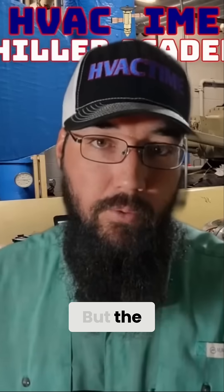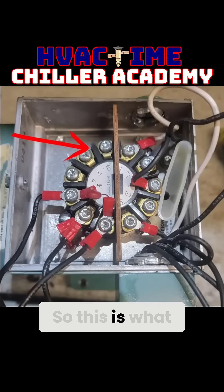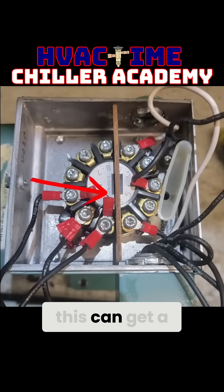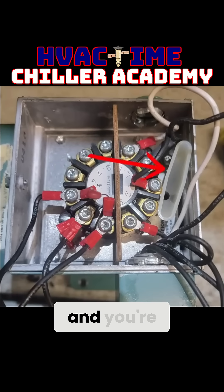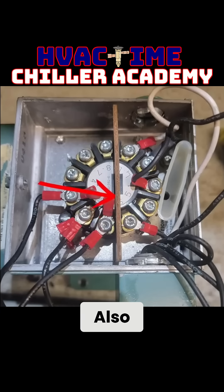I actually have a picture of this. The termination points — we also have relays in there. This is what that actuator wiring looks like. This can get a little complicated, so I'd say this is one thing to really pay attention to. Make sure everything is wired and labeled appropriately and you're really identifying what goes where.